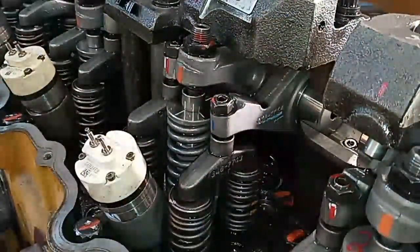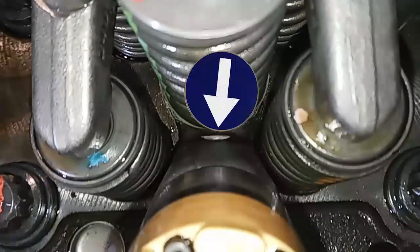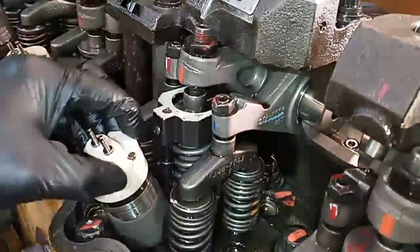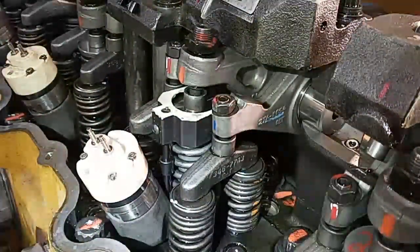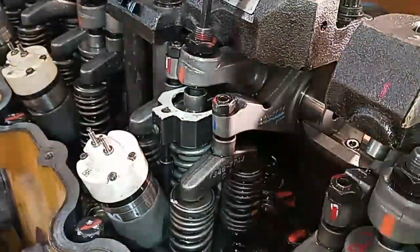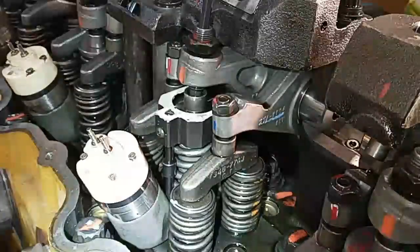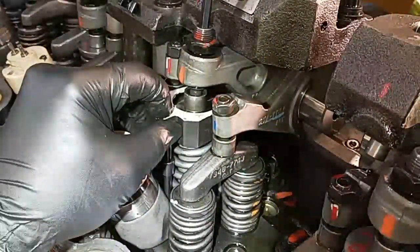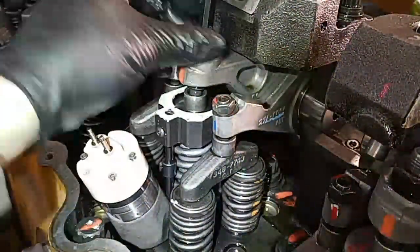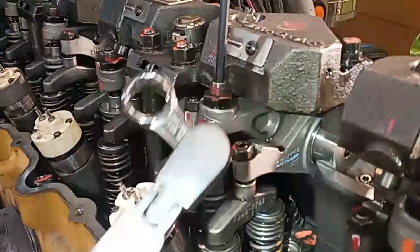You can do the injector adjustment by itself without doing intake or exhaust first. Place your injector height tool on it and make sure the arm is resting on the little ledge — keep checking it as it can scoot off and throw off your adjuster. The body of the height tool has an armature that rests on the ledge. The top needs to be about flush with the body. There's a step in the top of the armature; I've never seen CAT literature specifying exactly where it needs to be, so I set it so the high part is slightly above the body and the low part slightly below. Whatever you decide, keep them all uniform.